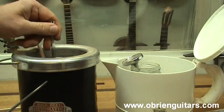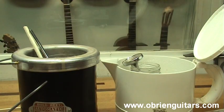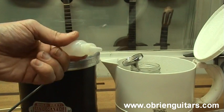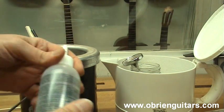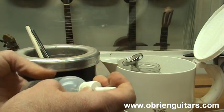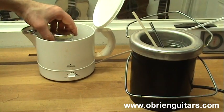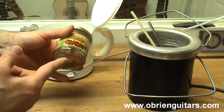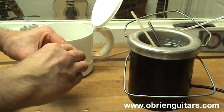To use the glue, you can just use a glue brush, but there are other options. A small container filled with hide glue gives you a dispenser just like a glue bottle. For larger amounts, use a bigger container. Once you're done working with hide glue for the day, just put the cap on and put it in the fridge — it will last for several weeks. When it starts to create mold or smells bad, don't use it anymore.